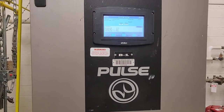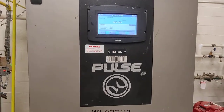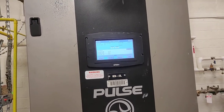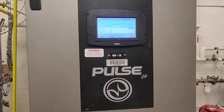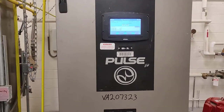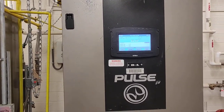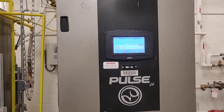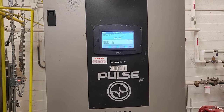The advantage to pulse combustion is that it's very efficient and it does not require any continuous ignition. You don't have to have a draft, induced draft, or forced draft fan running after the initial ignition takes place. So it went through its pre-purge, but now that fan won't run again until the post-purge. Each pulse ignition of gas and air will keep the cycle going until it's done running.